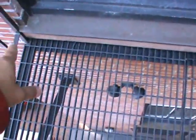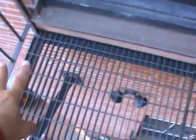I'm going to go down to one more platform. So this whole entire platform, the bolts that I'm going to show you from below are just half inch expansion bolts, and that is not proper. It's supposed to be 3/4 epoxy bolts into this, not expansion bolts.